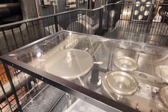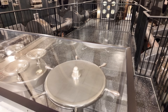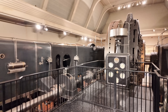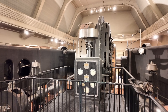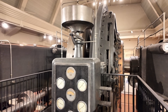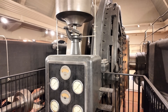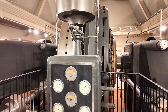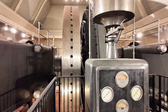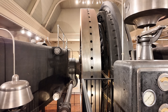When this was in operation, these are your main controls for this one engine. Remember there were nine of these at the plant. They produced a total of 33.75 megawatts — each one produced 250 volts DC through the huge generator, and each one produced 3.75 megawatts of power. For the Highland Park plant at full operation they were producing 33.75 megawatts. As of 2024, the average US commercial power plant in operation today is producing about 50 megawatts — meaning the Highland Park plant more than 100 years ago was producing almost as much power as a typical US power plant today.